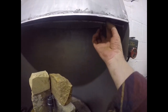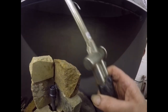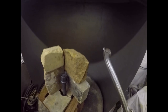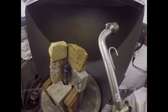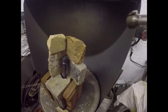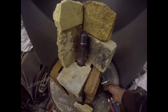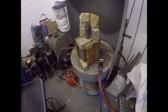I'm really pleased with this. I got this Flamfast burner and it was converted from what I presume was town gas to propane or butane — it'll run on either, you just need a different regulator as the pressures are slightly different, but this is jetted to run on either. It was just short of £100 — about £90 — to get it all converted and reconditioned. Flamfast: still in business after all these years, and a really nice company to deal with as well.